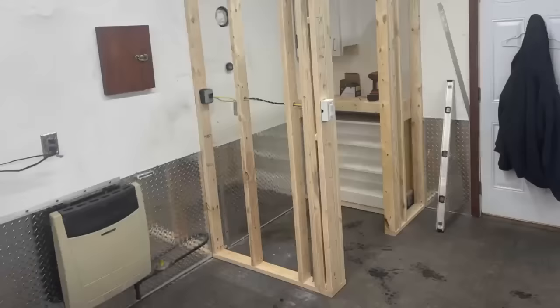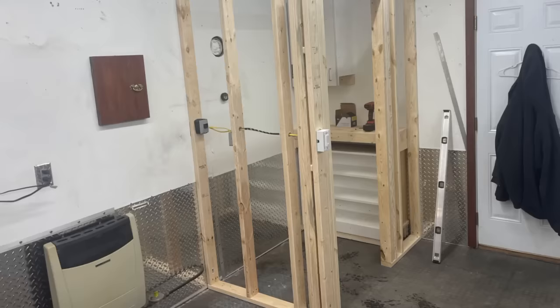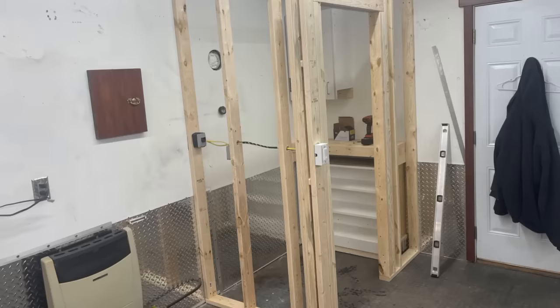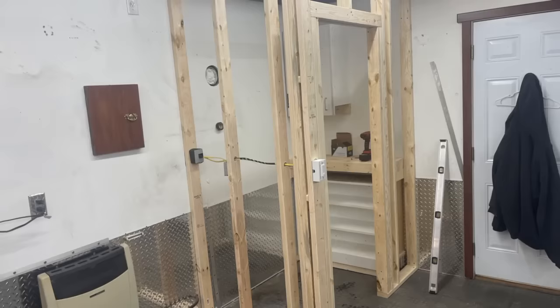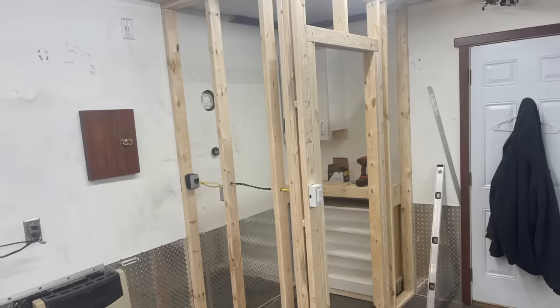So with that being said, let's go ahead and walk through what I did here. In this space, I had a refrigerator and I also had my gun safe. I removed those two items and it gave me an area of about three feet by five feet roughly. I just used standard framing construction, 16-inch on center with two-by-fours — no big mystery here, just basically building two walls, and I mounted those walls to the existing walls in my shop. I screwed everything into place rather than using nails because I had to basically stick-build it piece by piece.